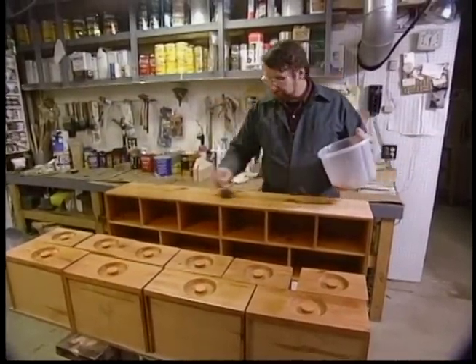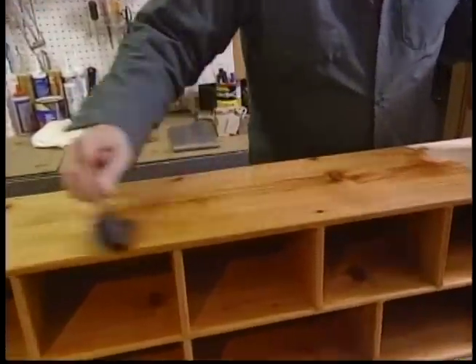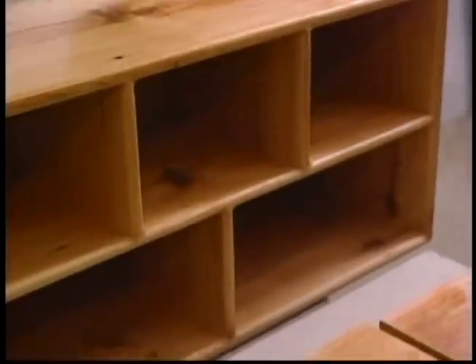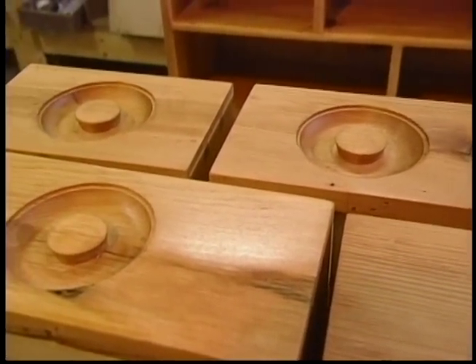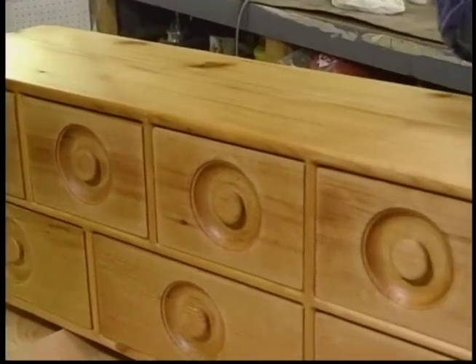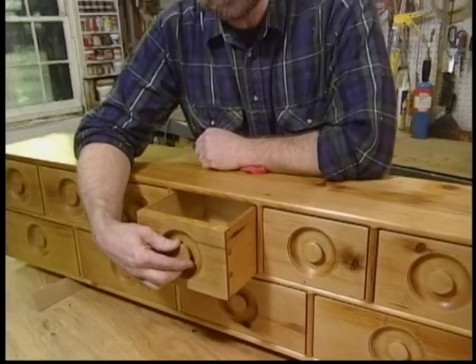Steve Swift, a furniture maker on the island of Nantucket, gave us the recipe for this finish. You start out with a couple coats of an oil finish — the manufacturer calls this one an antique oil finish. After this dries for about 72 hours, you can apply a coat of tough oil-based polyurethane. It makes the piece look great and the finish is durable. Here's what the piece looks like with a coat of polyurethane over that oil — I apply it with a brush and then wipe off the excess before it goes completely dry. The question is, what do I put in the drawers? I'm still working on that. See you soon! Bye now!